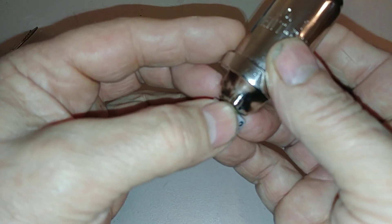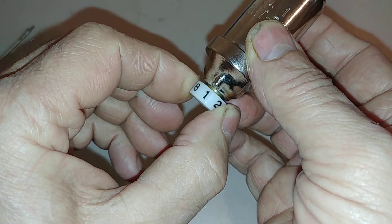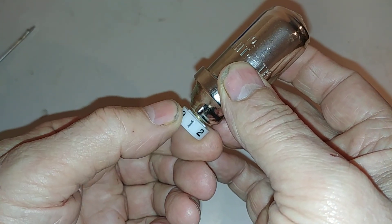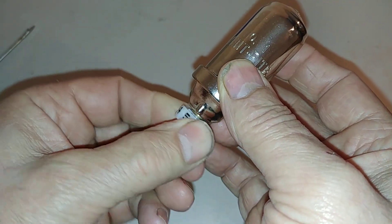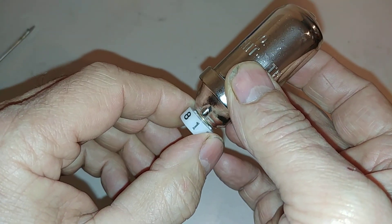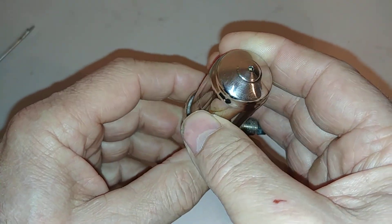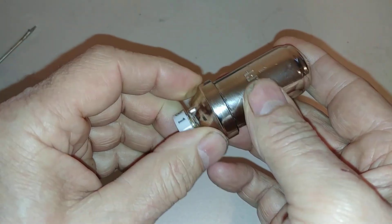This is the index mark, and this is in the shut position. You turn it this way, increasing the numbers, which increases the venting up to about eight. You basically get more or less one complete turn — position one is almost closed if not closed. You can verify that by blowing into here and turning this wheel; it should shut, though sometimes it doesn't depending on manufacturing tolerances. The ones that shut, you want to save.